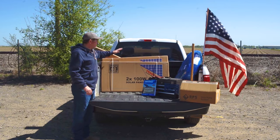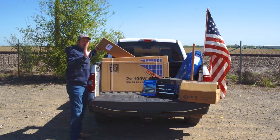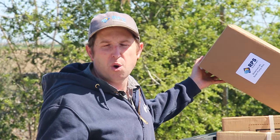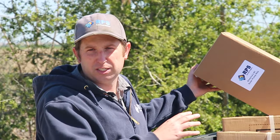Back behind me, we have our solar panels and our mount. The solar panels come shipped two per box, facing glass to glass — when you get these, you're going to want to inspect them and make sure there's no shipping damage. The mount contains all the aluminum parts you'll need to mount our panels on either our two-inch inside diameter post for a two-panel mount, or our four-inch inside diameter post for a four-panel and eight-panel mount.